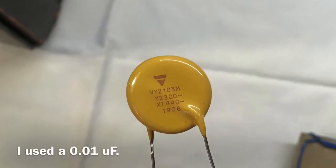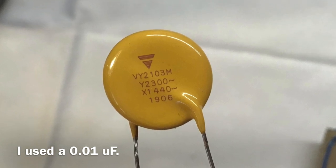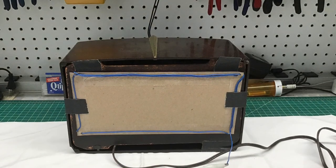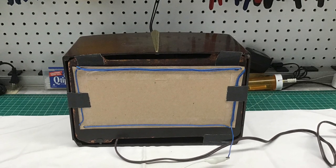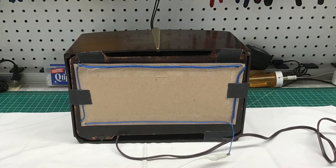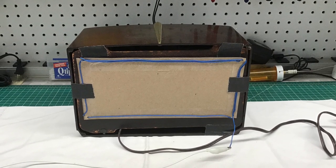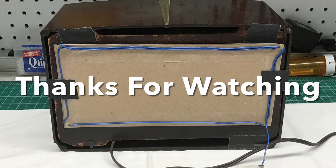My start winding attaches back to the safety cap — you see X1, Y2 — and that connects directly to the chassis of the receiver. The wire on the outside again connects to, in my case, what I'll call a short wire antenna, about 10 to 12 feet, elevated here in the shop.